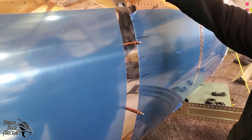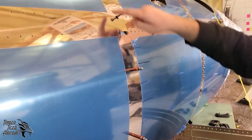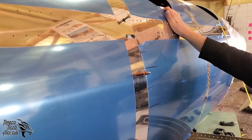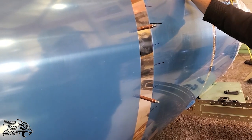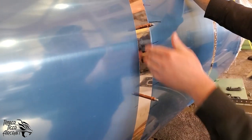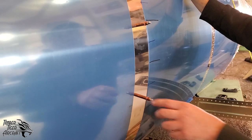we're going to go ahead and finish drilling 1/8 inch with our 6-inch drill bit all the rivet holes on bulkhead 2. Now, sometimes these get a little bit crooked, right? You need to apply a little bit of pressure on your 6-inch bit to keep it square with the skin when you're drilling inside out. So if you get a bunch of holes that are misaligned, don't panic,